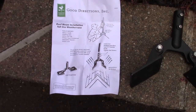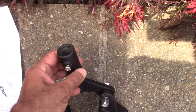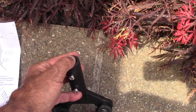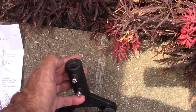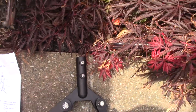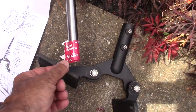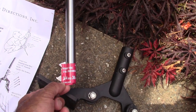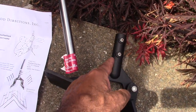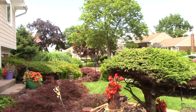One issue is I bought three-quarter inch, but the three-quarter inch is tight to fit in there. So I'm going to have to make a sleeve — an in-between sleeve — for my weather vane mount to fit on top of. I already bought a piece of steel for that. Here's a piece of raw steel, three-quarter by 36 inch, plain steel, 1/16 inch thick. This fits perfectly inside the mount and also inside the part I'm going to need from the weather vane.